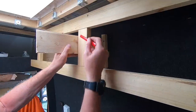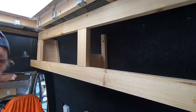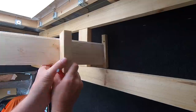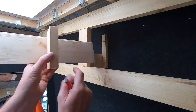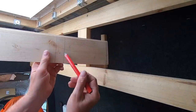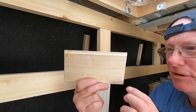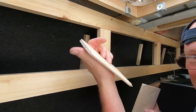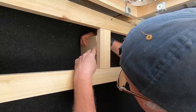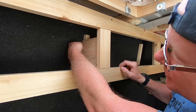Now I place it where it's going to go and to find where I need to cut this side, I make sure it's level and mark it. But that's no good because this needs to go inside, so I'll get an offcut, put it against the line like that - this is mimicking the panel - hold it there and mark down this side. So when I cut this line I know that panel is going to fit perfectly in there. There's our end result - and there you go, it does fit perfectly.